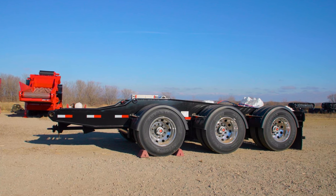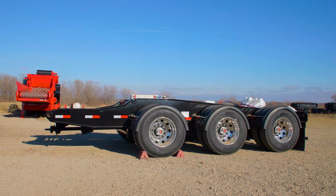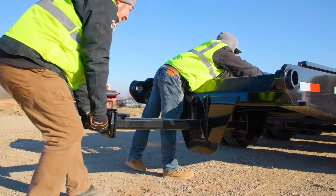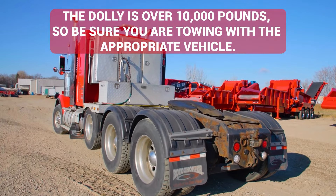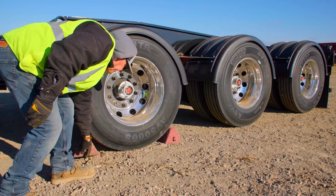A reminder that if the dolly is parked, there are no dolly brakes at the dolly air ports, so be sure wheel chocks are set in place on the dolly wheels. First, extend the drawbar from the front of the transport dolly and lock into position by locking the hook down on the drawbar end after fully extending. Align your tow vehicle and hook the dolly drawbar to the vehicle. Remove the wheel chocks from the dolly.